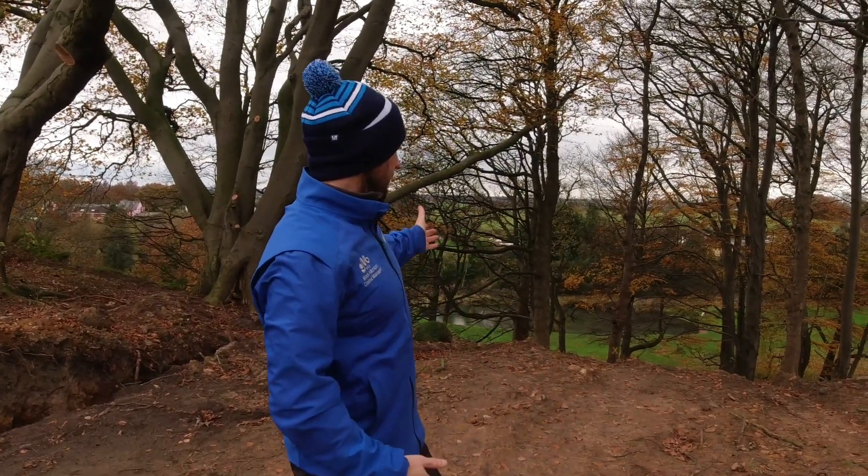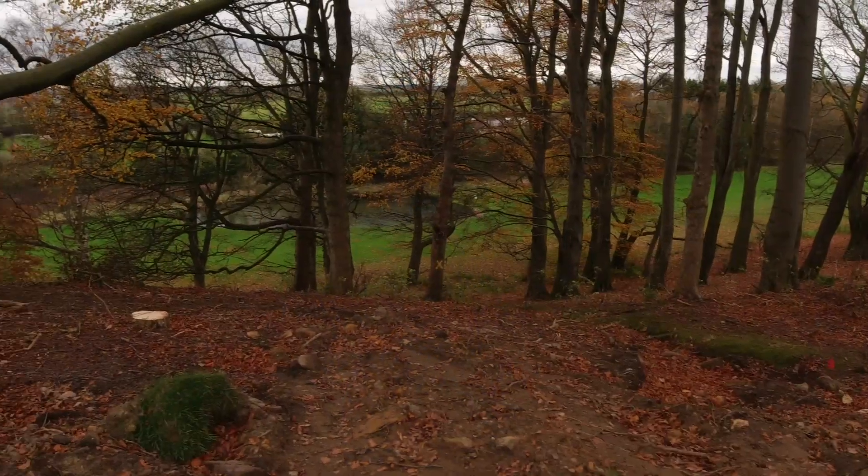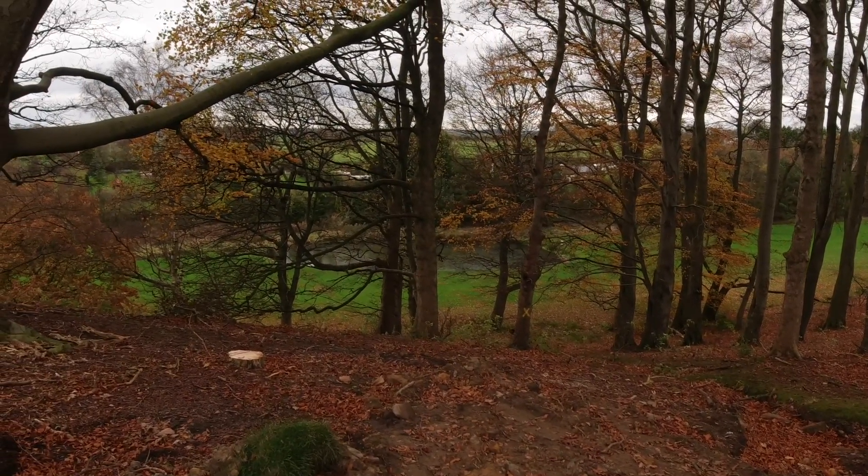When planning the installation of a new arterial network we always start from the outfall. With the ditch coming through the 21st and us draining this whole area from the 15th to the 22nd, we're going to move all the water down through the 14th bank and into the 14th lake behind me. Very much like we did on the 19th with the new waterfall feature, once we come back and finish this off, this will be the outfall for all the drainage work up on this top nine.